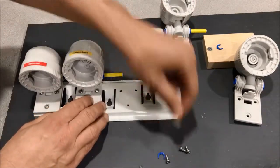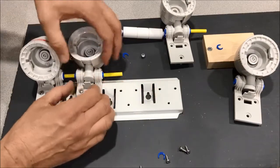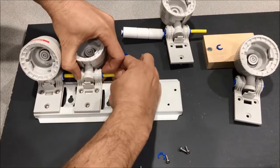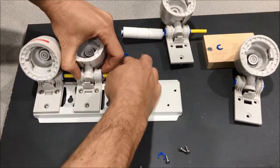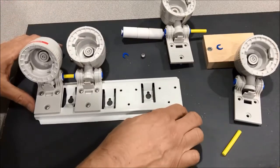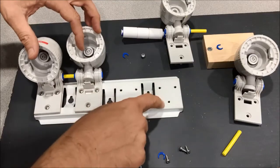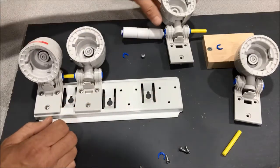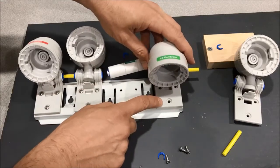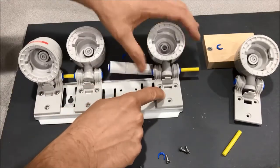At this point we also want to remove this little piece of tubing here, so we're going to have to take this last blue clip out. Push in on this collar here and then you can pull the tubing out. Now, because we need space between these to connect, we can use this last position bracket. We're just going to install the membrane head here so that we've got a space between it, and we'll go ahead and screw this down.